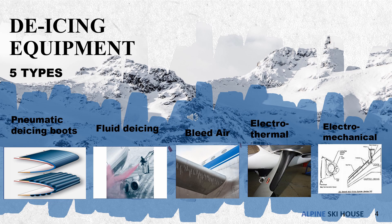The fifth type is electromechanical de-icing equipment. Electromechanical expulsion de-icing uses a percussive force initiated by actuators inside the structure, which induce a shock wave in the surface to be cleared. Hybrid systems have also been developed that combine the electromechanical expulsion de-icing system with heating elements, where a heater prevents ice accumulation on the leading edge of the airfoil and the electromechanical expulsion de-icing system removes it.